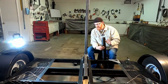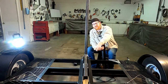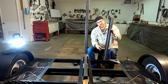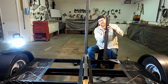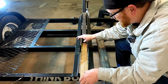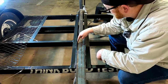We've got the bottom hook pin assembly complete. Now we need to work on lining up the top latch that will go to the existing trailer pins. I want it to be able to come into a C channel, and I want a horizontal latch system — like a gate latch — that comes into the slot and then has a spring catch latch grab onto the bolt. I'll mock this up and tack it in place once the height is right.